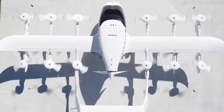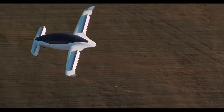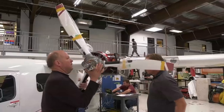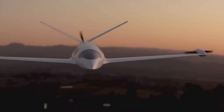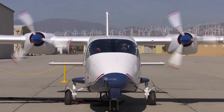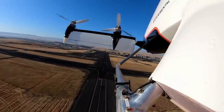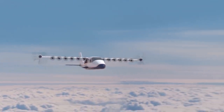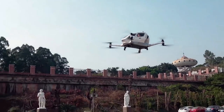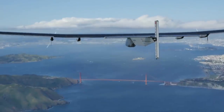The fascinating thing about electric aviation is that it has created the possibility of entirely new aircraft designs, the likes of which we have never seen before. The lightweight yet powerful electric motors can be installed anywhere from the wingtips to the fin tips. The need for control surfaces is reduced because turning of the aircraft can be achieved by spinning the motors at different speeds. We can use multiple small propulsors instead of a few large ones. We can have no wings at all. We can recapture energy during landing. We can generate energy during flight using solar panels.